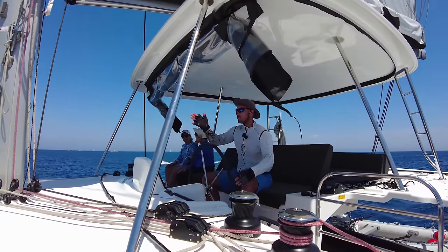Now, looking at these two boats, you see, it's not the best strategy what they did, because they have the wind perpendicular, right? And if they watched the weather forecast, they knew the wind is going to be like this. So this is the worst position you can be in. If they would be hit by very strong winds like this, the surface area of the boat is huge. And the strength on the anchor is enormous if you get winds from the side.